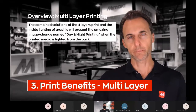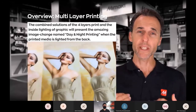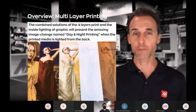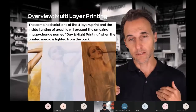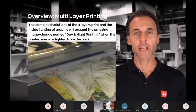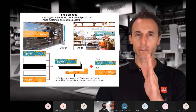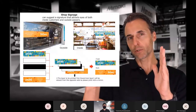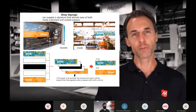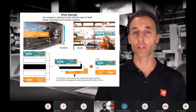We can do multi-layer printing to create different effects, benefits, and application solutions with the UCJV300. We can print up to five layers simultaneously. That's the beauty of LED UV printing — we can multi-layer without worrying about drying because it all happens immediately. Why would you need five-layer printing? Imagine creating a two-way retail window graphic with one print: a black channel in the middle, two outer white layers, then inside and outside view graphics — all from one graphic. Huge benefits you simply can't do with other formats.